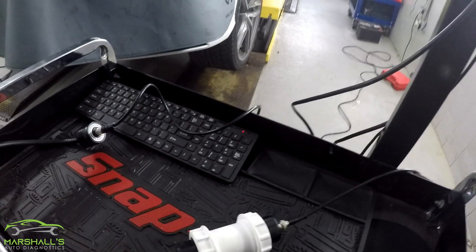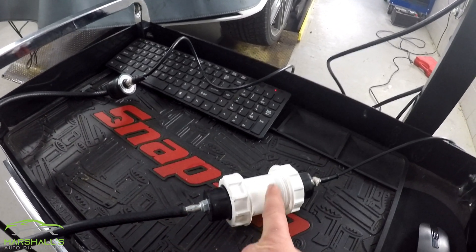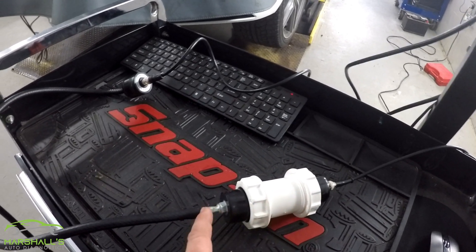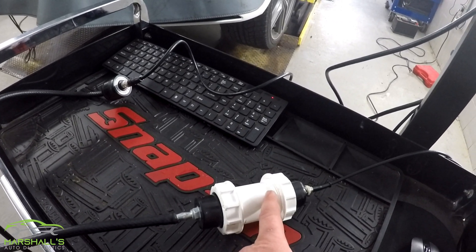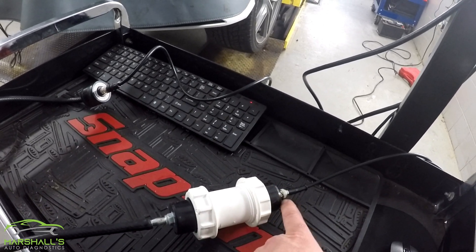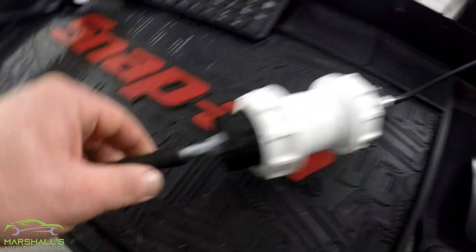Basically what's happened here — the chamber here has a wee shelf, with a piezo sensor sitting in there that I've glued on. Air pressure comes in, hits against the sensor, and the sensor creates a voltage. I've soldered a couple of wires onto the sensor, connected to the BNC adapter that I've installed inside, and obviously just a hose at this side. That's going into my second channel, and the first look sensor is on my first channel.